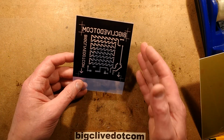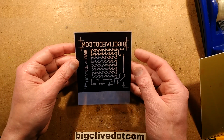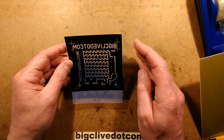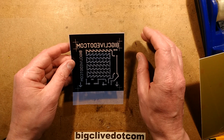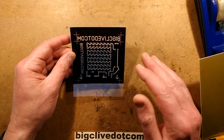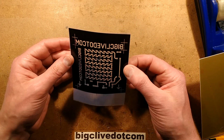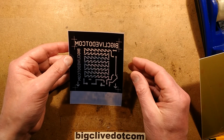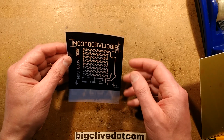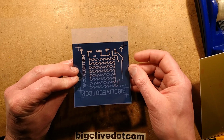So you also set the printer settings to absolutely pile the ink out. Maybe glossy photo is going to be enough, but in my case, I chose glossy photo plus. I went to the color adjustment settings in the Epson printer and the control interface from the laptop, and I set all the color settings to their most extreme levels, so it produces a fairly dense black. There's a very strong contrast. Otherwise, it sometimes tries to make a black using cyan, magenta and yellow, and it's not quite the same, but this does soak in a lot of ink, so it's not that bad.